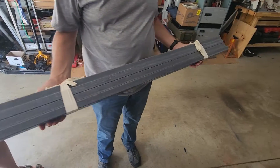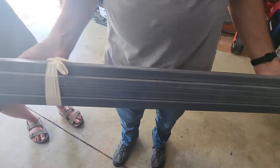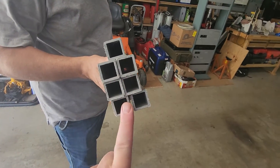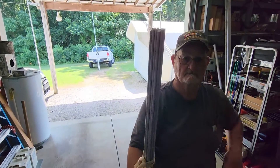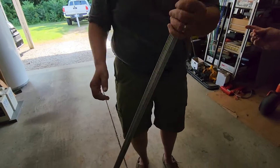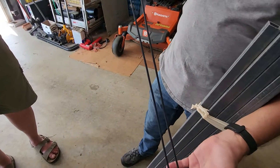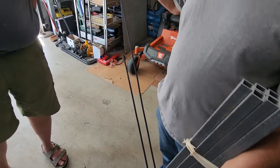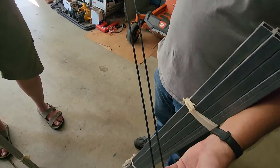We're going to need several 2-meter antennas and 440 antennas. This is some stock that AC4DM had on hand — purchased many years ago for other projects. It's about one inch, maybe a little bit more, of square tubing, and you can actually mount the aluminum elements for the antenna on that square stock. Club member Howard is showing some of the aluminum stock he also has on hand. To use as the driving element, we're going to need copper stock, and this is showing one of those driving elements he had previously made — it looks black, but that is copper.